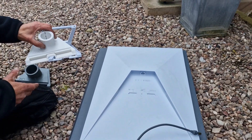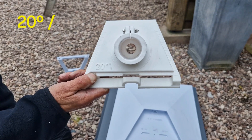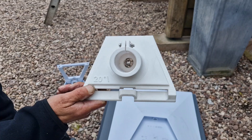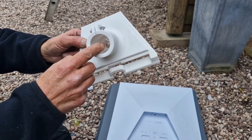We've got two mounts. This is the modified new one — it's got 20 degrees stamped on it. That's the optimum angle for any Starlink system; any other angle is not optimum. This is the one we're going to fit, which is a 1.5 inch mast.